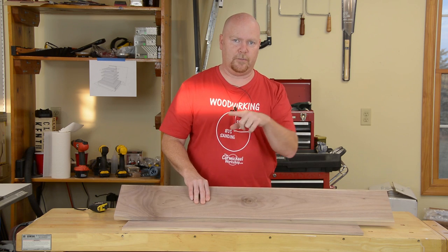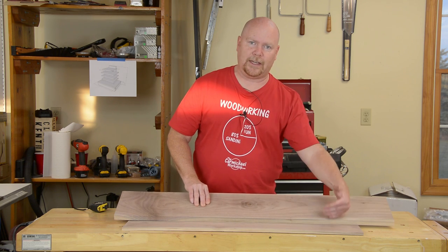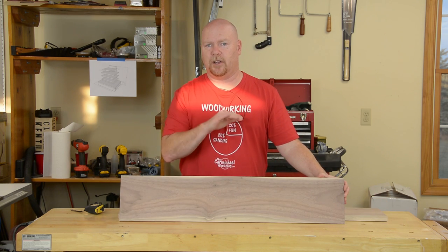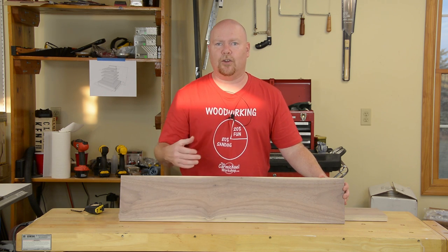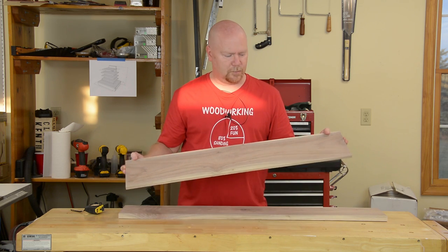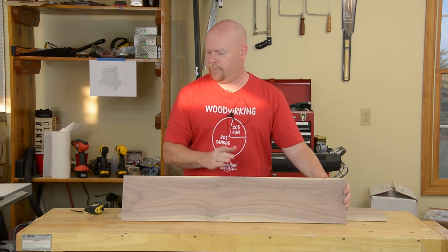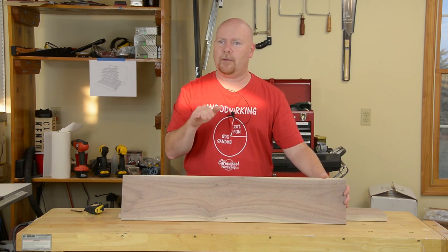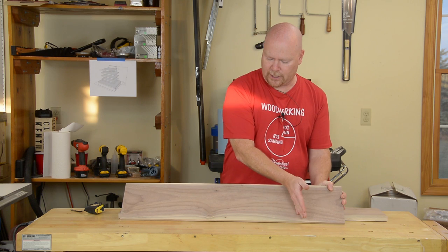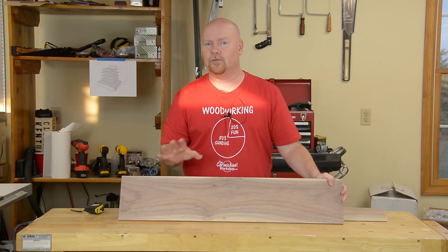The thinner rail stock that makes up the sides of the base I'm going to take out of the section above the knot. There's heartwood and sapwood on either side, but there's plenty of good walnut right in the middle for all those strips. The thinner stock for the shelves has lighter banding on both sides, and I need the full width of this board. I don't need the entire length, though. The very top shelf is only 5 inches wide, so I'm going to be able to take a shelf, skip a bit, shelf, shelf, and end up with pieces that are at least relatively consistent.